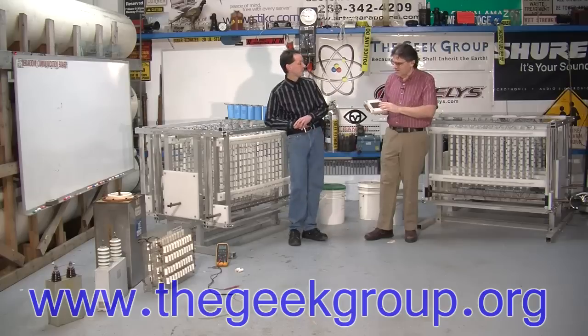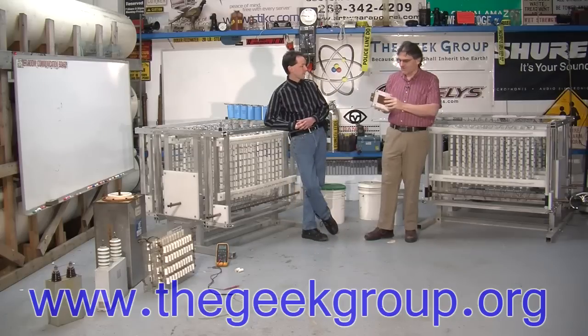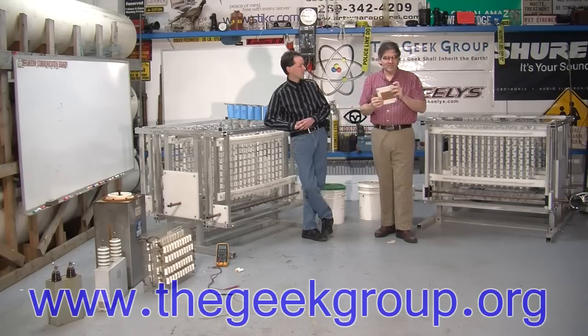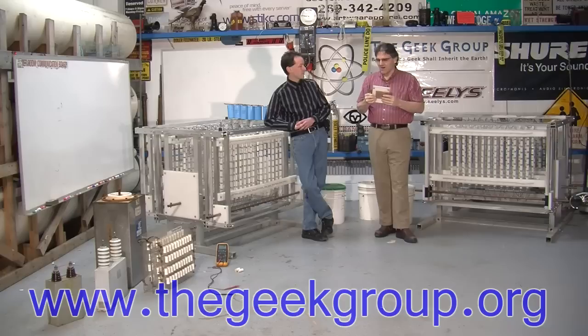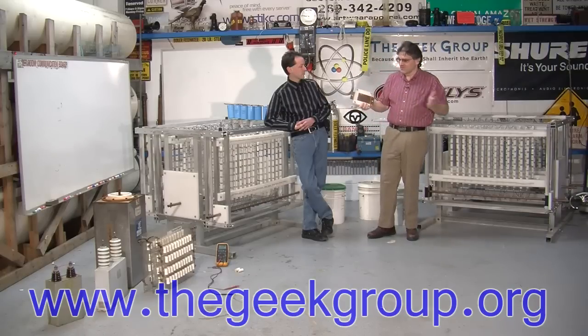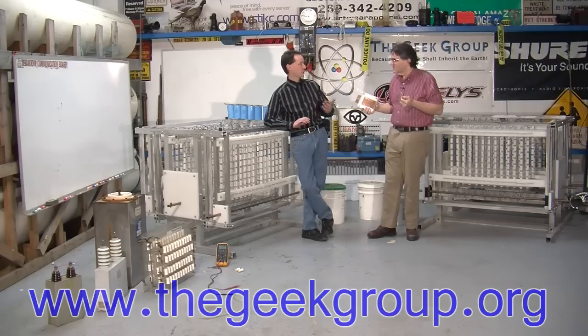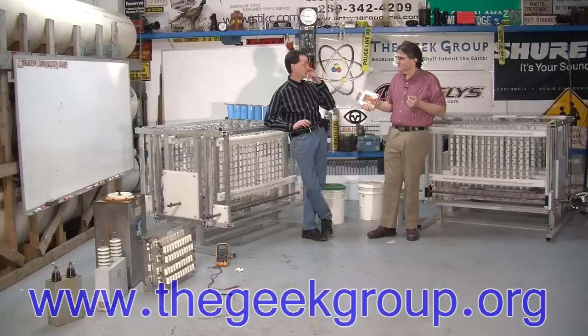But this is the simplest example of a capacitor. A capacitor stores energy in an electrostatic field. So it's the electrostatic field between the plates where your energy gets stored. There's a lot of different varieties of capacitors for a lot of different purposes. We have several of them laid out around here. We're going to primarily talk about ones for Tesla coil use, though, because that's what our viewers want to see, because they're building Tesla coils.